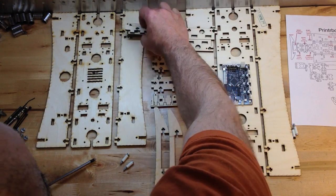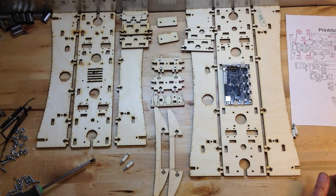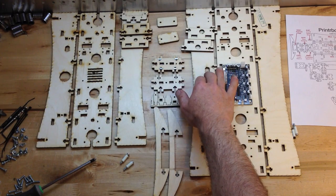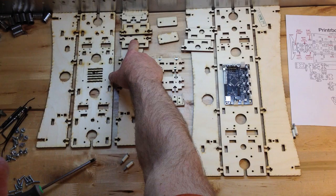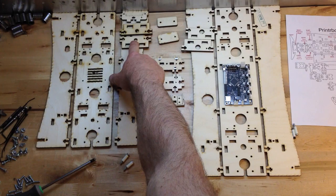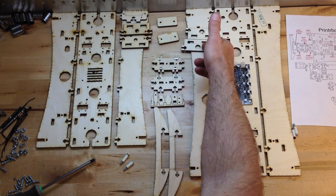The parts in the center are common parts — shared on both bots. The parts on the sides are specific to each model. One other difference between the LC and the PLUS is the Z rods. This is the LRDC, or lower rod LC — the lower part where the rod pokes through and is held. These are 8mm rods on the LC, and these are 12mm rods on the PLUS, so the cost is greater on those.